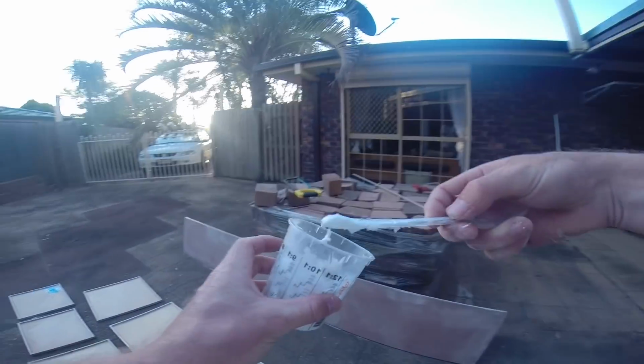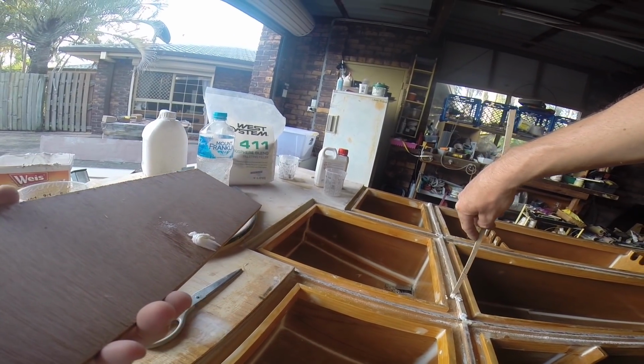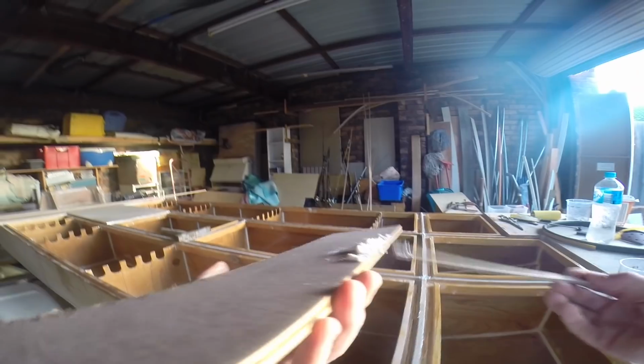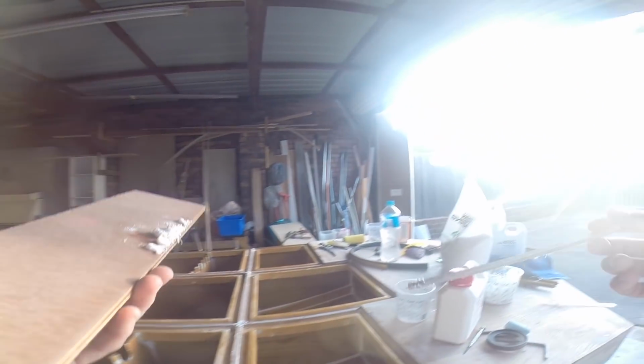So they're tacked. Finish off these holes before it goes off. Scraping off the excess is a lot easier than sanding, so make sure you do it. So that's our first little cappers. We're going to let that dry overnight. So I've only done the 3 points that were the lowest. The rest of it's all just going to get straight 12 mil on top.